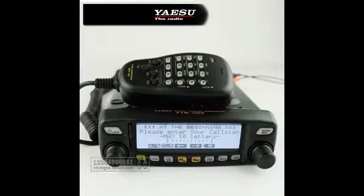and a room number. Now the room number is not really important because unless you have an HRI 200, which is Yaesu's little box that makes the FTM100 or 400 or the FT2 or FT3D HTs, any of those four radios can be used with an HRI 200 and a computer to become a Wires X node and room. You will be issued both a node number and a room number, though you'll need to put them both in when you start the software. You'll notice the room number and node number are 10,000 apart. For example, if your room number is 28592, which is the room number of our Phoenix Fusion group, the node number for that would be 18592.